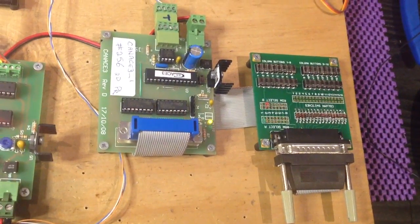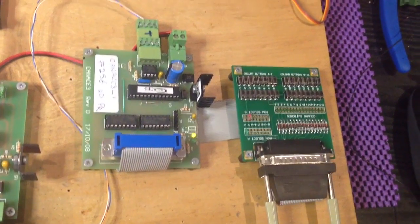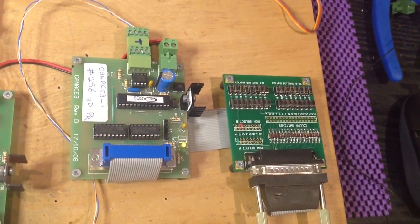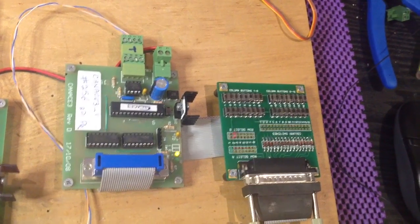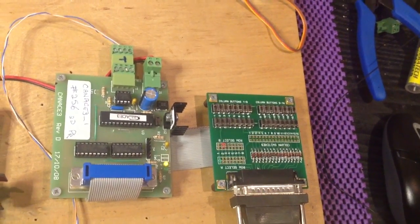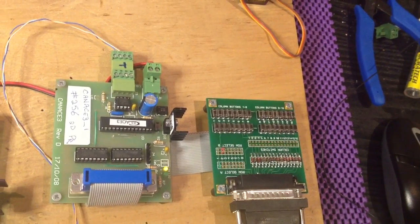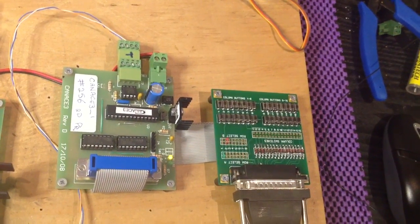This is a quick spin around my CBUS Test module board. Basically what we're looking at here is one end of the CBUS bus. The connector on the top of that CAN ACE3 module is basically a connector going straight into a female connector with a resistor on the bottom of it to terminate the bus. And then that goes into the module.